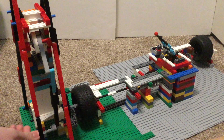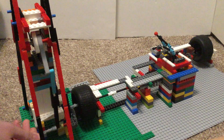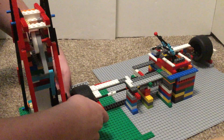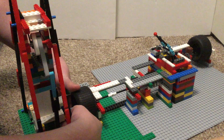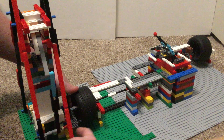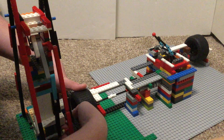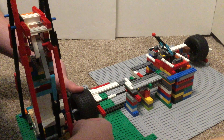Oh, the vacuum engine broke. As you can hear, I did improve it — I put a bigger valve in it, so it runs faster now. That's also why it sounds like a lawnmower engine. But the timing gear down here, that goes from the crank to the camshaft on the side, got loose and disconnected. So I've got to retime it.